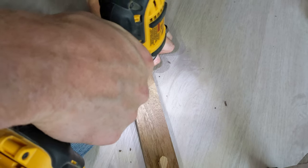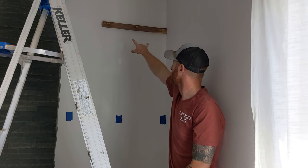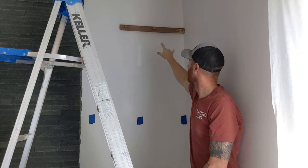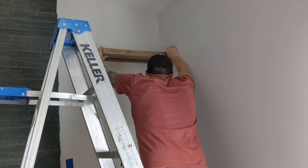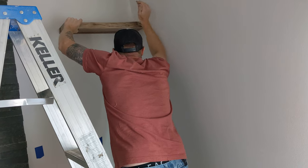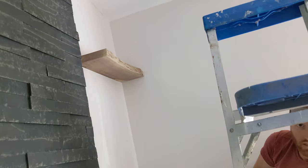I finish pre-drilling all the way through and then countersink so that the screw head sits below the surface of the lumber. I put two three-inch screws, giving me a little over an inch of actual screw into the stud, and it's mounted super solid. Now it's just a matter of slipping the actual shelf over those dominoes and securing it. It can be a little tricky on a ladder, but you line up one side, pop it into place with your hand, work across the middle and then the far edge. In the end I was really happy with how snug these fit.